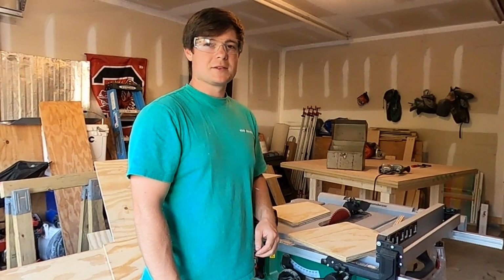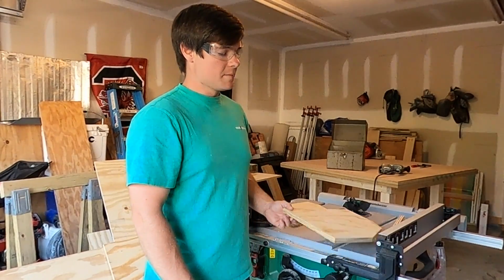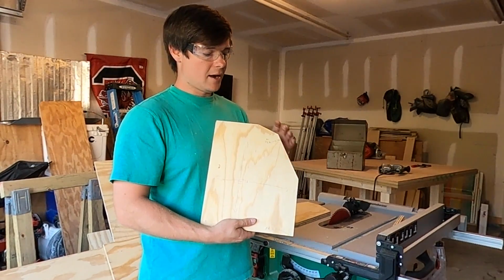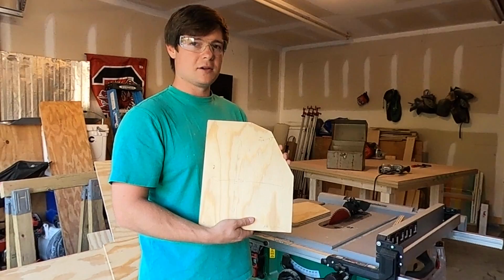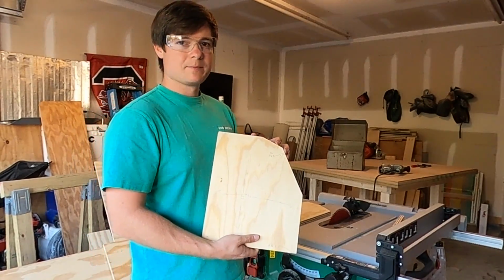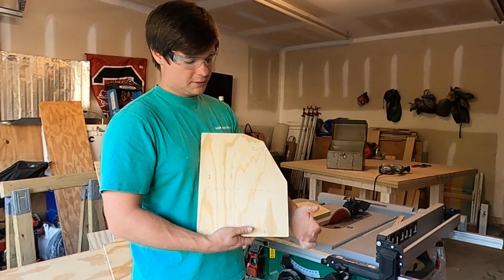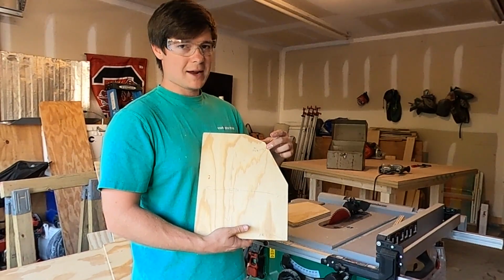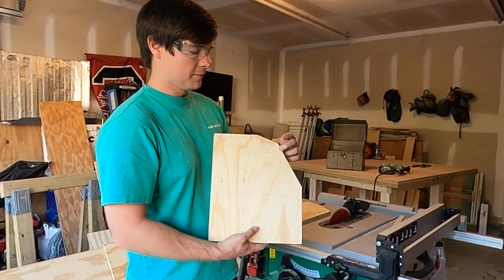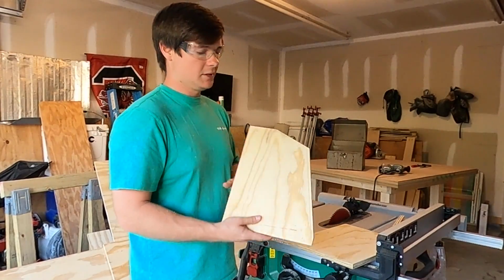Making the upper cabinets that go in above the bed inside the van. So what we've done is made a template that we started out with, and I made some rough cuts on the saw using the miter stop in order to get close. And once I was close, I then took measurements at different points. So one at the end and one right here that went to the joints in the van where we framed up the roof. And from there, I made a more accurate template, which is this template.